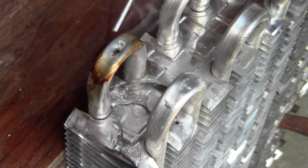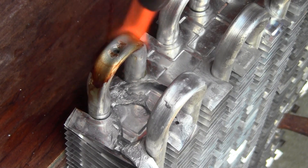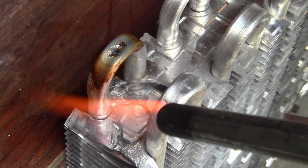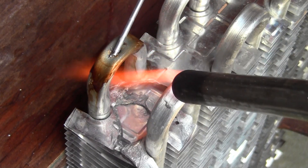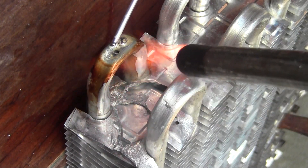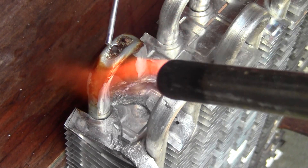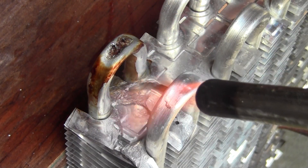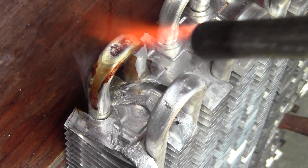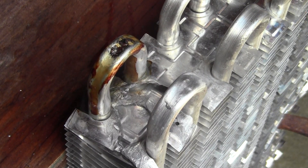As you can see, it's just starting to tin — tin meaning a very thin layer of rod is rubbed onto the base metal. Go ahead. Try to heat from below while you're doing that. Heating from below or to the side will maintain the heat while you're adding the rod. Just lay that rod on top of it. Now grab a little more flux. Watch for that glassy look. After adding the rod across the hole, applying a few more drops of flux while hot will seal the system.